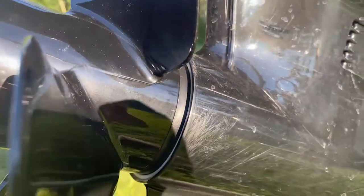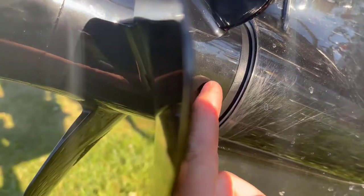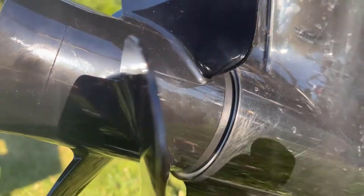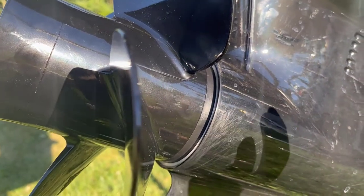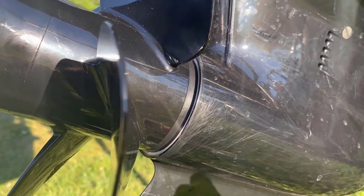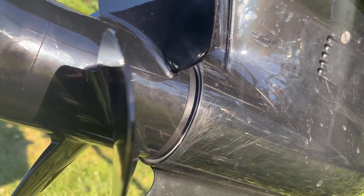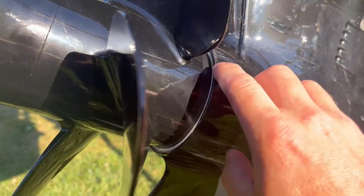Earlier we looked at that collar — that helps with the gap between the prop and the motor. Without that collar there would be a gap on this prop that would allow exhaust gases out, which would get bubbles all around here. Just like high divers when they're practicing jumping into a pool — they flood the pool with bubbles so there's essentially no water, they decrease the density by making it a homogenous gas-slash-liquid mix. That's the same thing that would happen here: bubbles coming out and the prop wouldn't have any water to grab onto. So that's why we need to make sure that collar is in place.